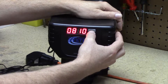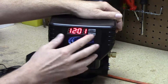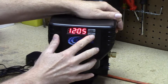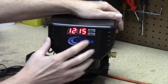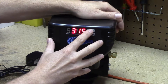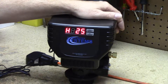Press and release the upper button — the menu enter button. It's flashing 12:01. Say it's 3:15 PM right now. Press the set change button; the ones place is flashing. Put it at 5 for 3:15, press menu enter, skip to the tens place, press set change — now we've got a 1 for 3:15. Press menu enter; the 12 is flashing — press set change to get 3. Now all digits show 3:15. Press menu enter and select PM. The valve is now set to the correct clock time of 3:15 PM.